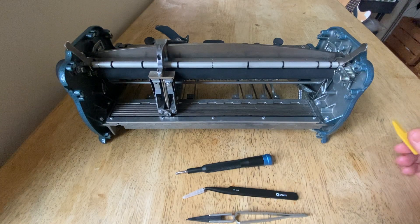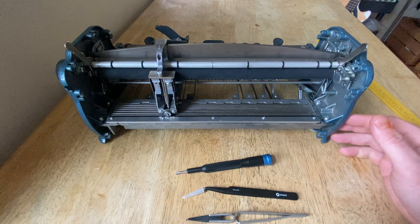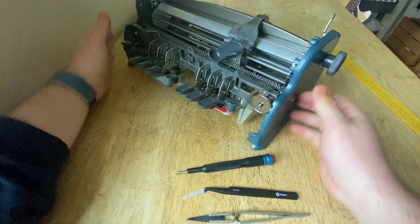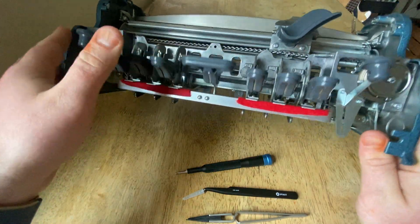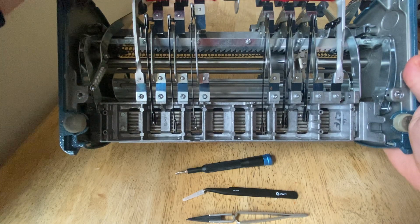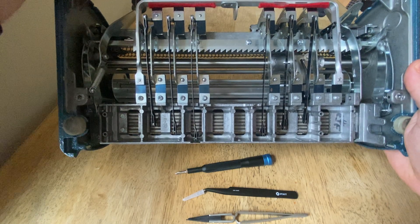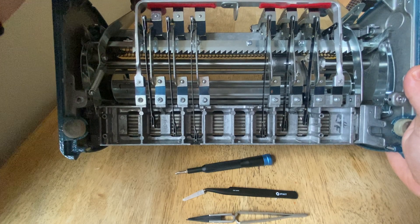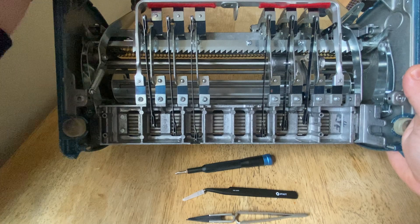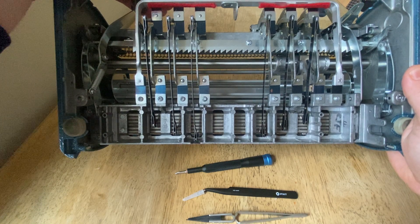It took me taking it apart to understand. So what happens when you press a Braille entry key? The keys on the Perkins Brailler are engineered so that when you push down, the lever creates a pulling force and it rotates this rail that runs all the way across the back of the Brailler — it's 11 and one-quarter inches wide, which kind of matches up with your Braille paper. Wherever the embossing assembly is along this track — and there are six rails, one for each dot — when you press a key it will rotate and press a dot upwards to emboss.